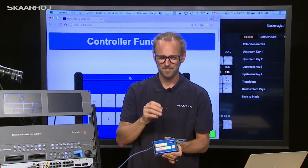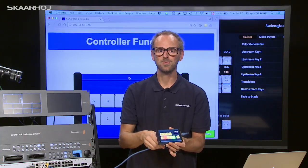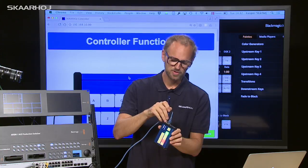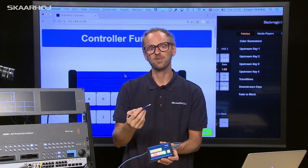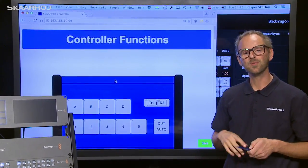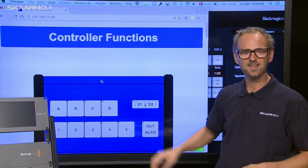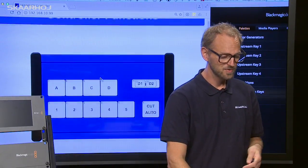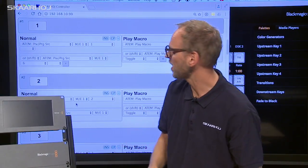But if you want it to work differently, you can easily change this on your own. No complex programming, only the technology of a pen tip. You push and hold the config button on the controller to bring it into configuration mode. Then you need a computer and a web browser, and you get embedded in the controller a web interface like this with a graphical representation of your controller. All you need to do is — pretty intuitively — press the button if you want to change the function of that button.